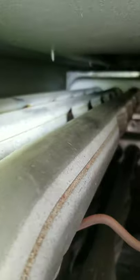The heat exchanger on this one looks newer. It's not as bad as the other, but they usually have a few cracks back here — right in all those indications. I'm gonna go ahead and wrap both of these up and try to get some new units out here.